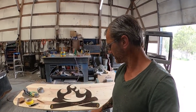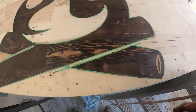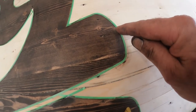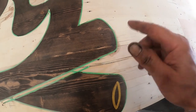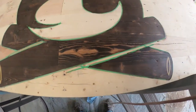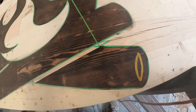Now I've got my stain on here. You didn't get to see the whole thing because my battery went dead part of the way through, but I got all the stain on here. We still got it masked up — now it's time to go ahead and unmask it. As you can see, I had to be very precise when trying to put stain inside of this eighth-inch tape, and in some spots I got outside of it. The way you take care of those is, once you get that peeled up off there, you just go over it with some sandpaper very lightly and they'll disappear. We'll go ahead and unmask that — see that line, look how sharp that line is. That's every bit as sharp as any wood inlay job would ever be.